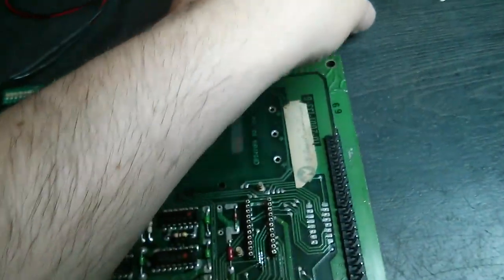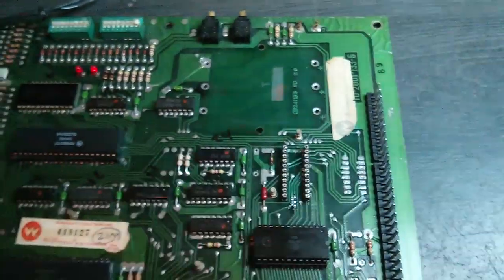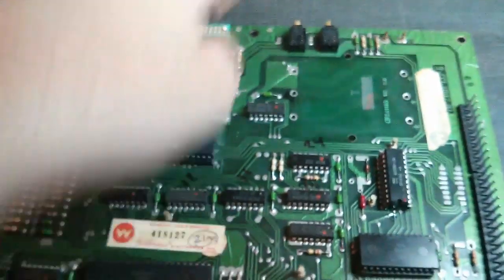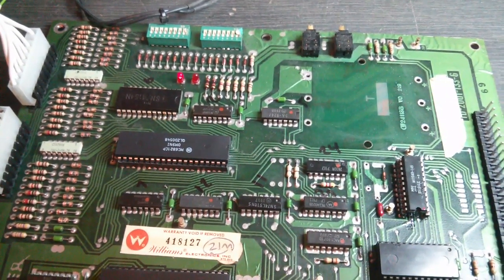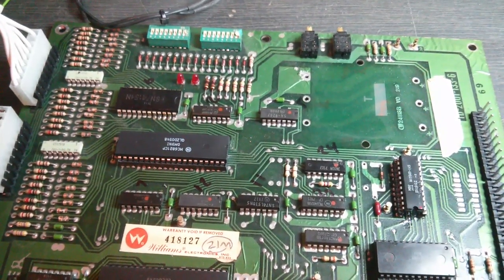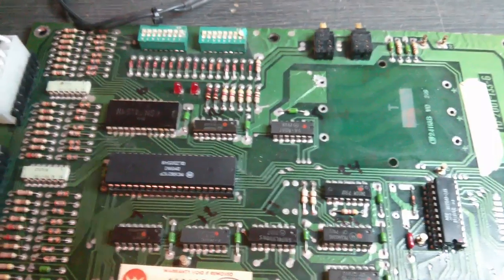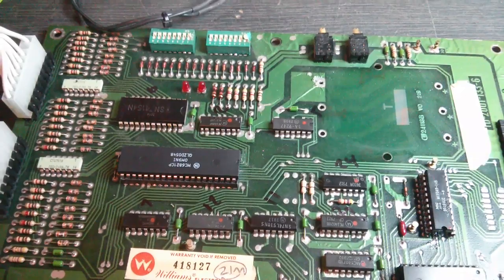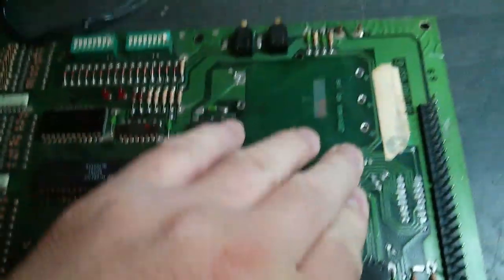I'll see if I've got any of my Arcade UK ones in stock, or actually I'll just stick a normal RAM in first just to see if I can get it to boot with a normal RAM. With a normal 5101 in place, it's booting up again. We'll stick a RAM test on. No RAM faults here. That NVRAM module does not work.